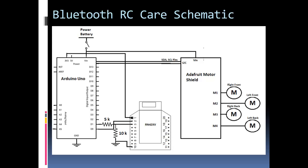I also have my Bluetooth module with a voltage divider on the serial port transmitting from the Arduino to the RN42, because the RN42 is 3.3-volt logic. When transmitting from the Bluetooth module to the Arduino, 3.3V is enough for the Arduino to read a high, so I didn't put any voltage conversion there. The battery power comes in and I'm using Arduino's regulator, keeping it between about 7 and 12 volts. I found the Arduino's regulator wasn't enough to power everything, so I'm using the motor shield's separate regulator. I have separate power inputs — one going to the Arduino which also powers the Bluetooth, and one going to the shield.